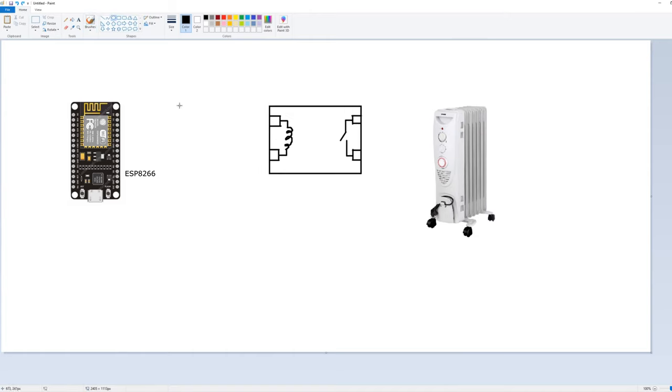Something like that. And the relay driver circuit is going to be based on an NFET transistor. And we've got a couple resistors here. And there's going to be a diode over here. It's almost like this is acting like a relay to the relay.